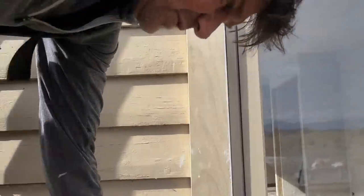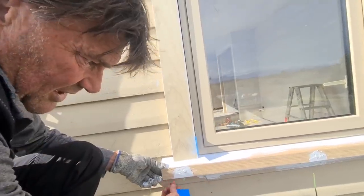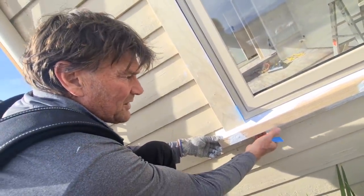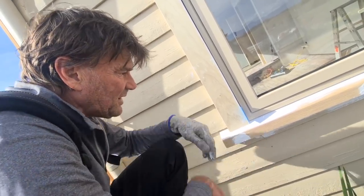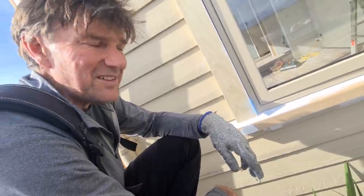Well, this sill has had the back relieved out of it as well. Unlike in the old days, this would actually go through the weatherboards. So there'd also be a groove cut along the back called an anti-capillary groove, stopping the water from being blown up underneath, potentially into the opening, which is probably what happened with the old stuff, which was why it was so rotten around there. Yeah, right.